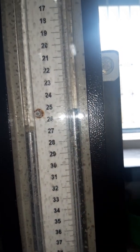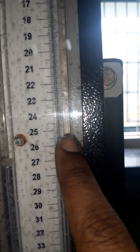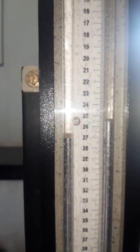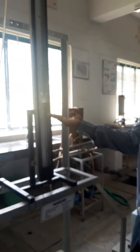Wait for about one minute so that you can take down H1 and H2. H1 you can clearly see is about 27 and the next one is 25.6. Whichever limb you designate as H1, Rm is nothing but the difference in height. It depends upon you how to take H1 and H2 — what to consider H1 and what to consider H2. Don't get confused — it is just a difference, H1 minus H2.